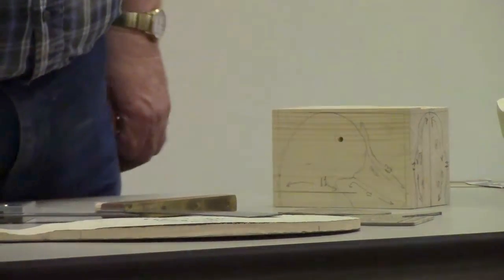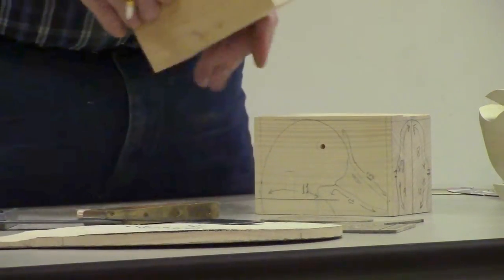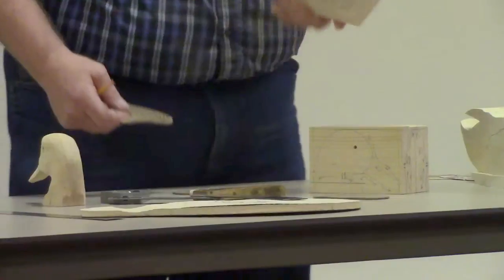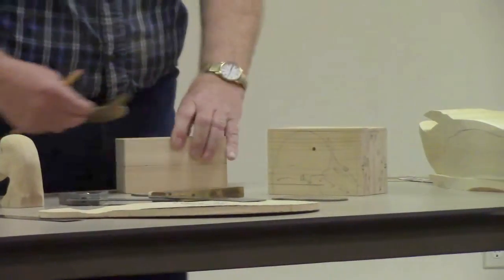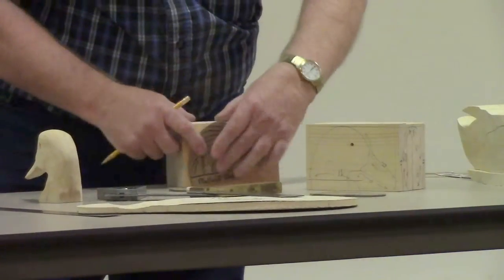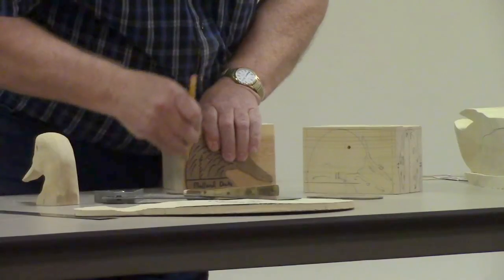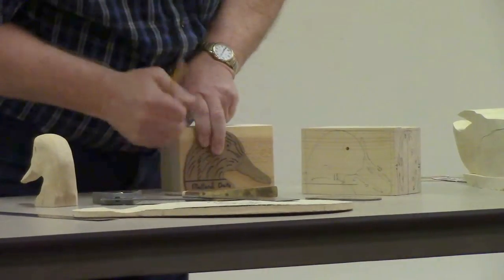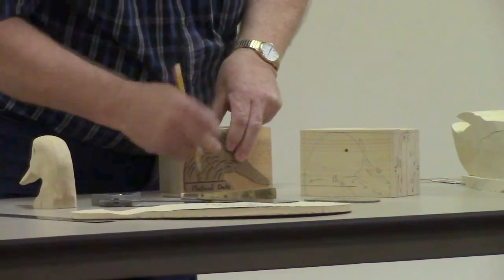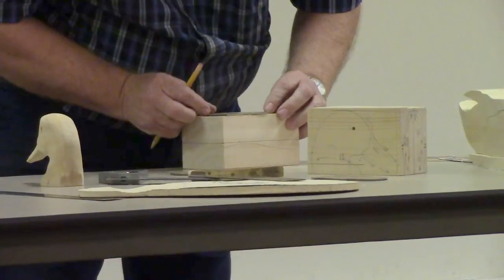All right, so this is just a blank block. I kind of skipped ahead, but here again, the importance of square, chase that line all around, and these patterns just will fall into place, like I say, in about 2 or 3 minutes. So this has no other marking on it. Square this up in the bottom, that'll give you that flat surface. Divide up what you want left for scrap, so this will be laid out in about 3 seconds. Chase that around.